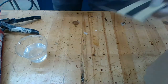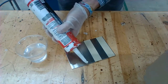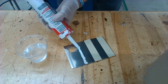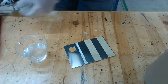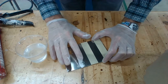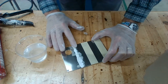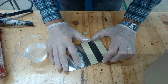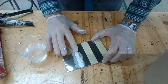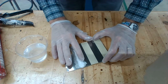Now we're going to do a fillet seal. This does go by pretty quickly. Same thing — I'm just going to pull a bead along here. It's just like caulking, but the only difference is you don't clean it up like you do with caulking; you leave a lot more material on there. Same thing — put my fingers in the water and make sure we're down here. I want an overlap fillet seal, so it's overlapping the top and the bottom is fully formed. No moisture can get through there.